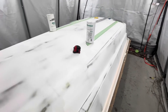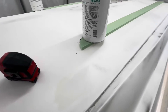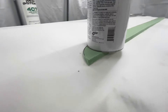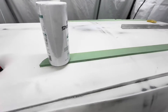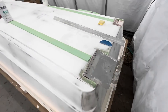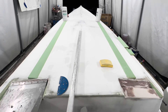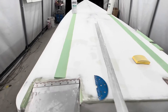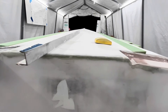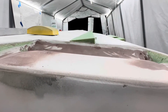I've got these lifting strakes glued down now. I'm going to have to sand down the leading edge on these - you don't want that sharp 90-degree edge, obviously. They're looking good. They go right before the trim tab pockets, and they are perfectly measured to be as straight as possible. A little bit of reverse chine - I think it's going to be good.